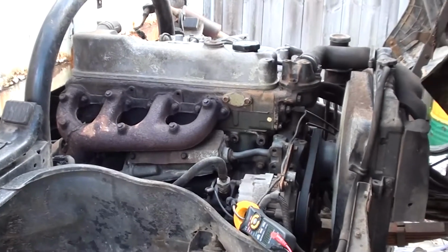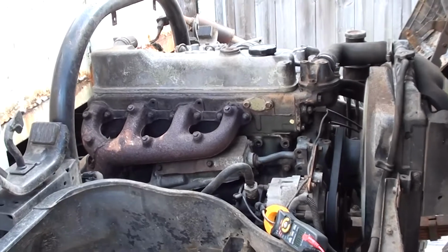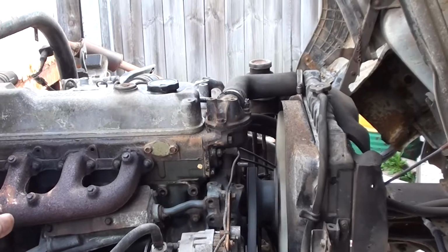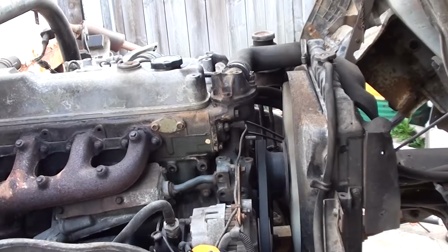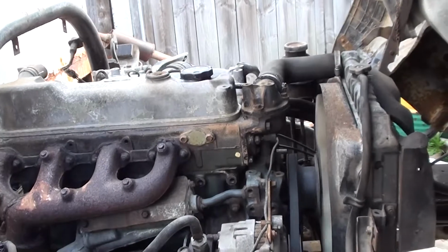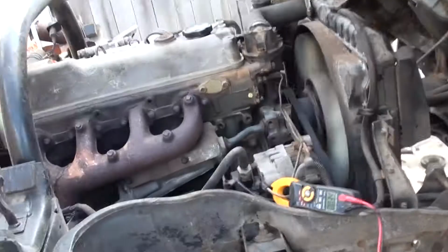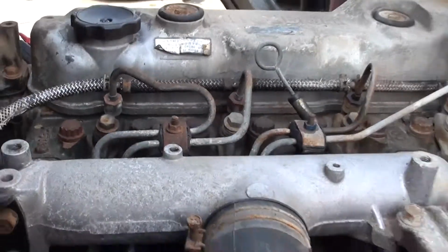They're only a pair of car battery size batteries to start it. They're not huge. It does run a 24 volt system, but it also is running a 4-cylinder relatively high compression diesel because it doesn't have glow plugs. It starts without them. Or if it does have glow plugs, they're all automatic. You don't actually get a chance to run them or see them run. Oh, look, have a look. Yeah, no glow plugs.